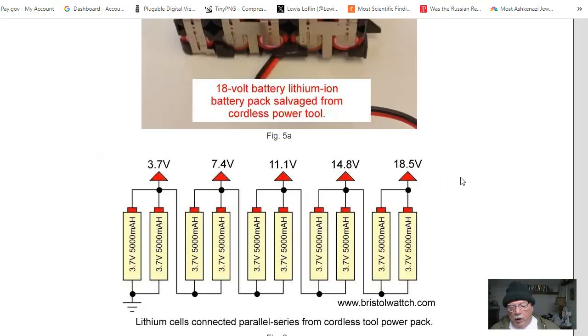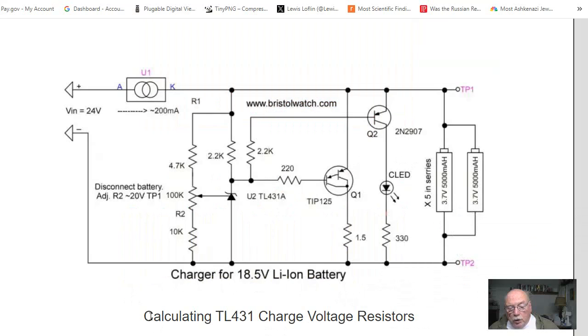The cells were very close and would probably work for a while, but if you use this regularly, the differences in charge voltages as they charge up will begin to vary. It's possible that one may take more or less time to charge up, and you could overcharge one or two of the pairs — that's why you need to do load charge balancing. One last issue on the charging circuit is this resistor down here, which was 33K before.